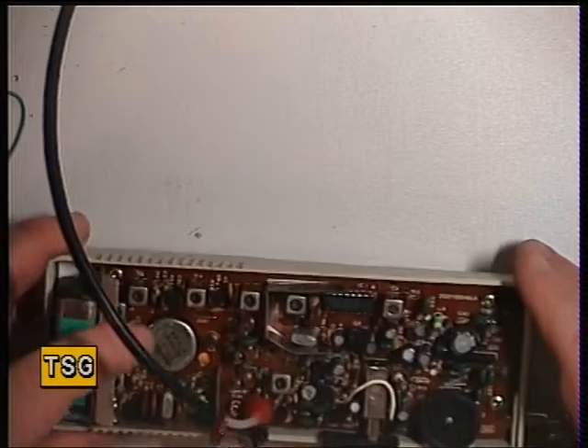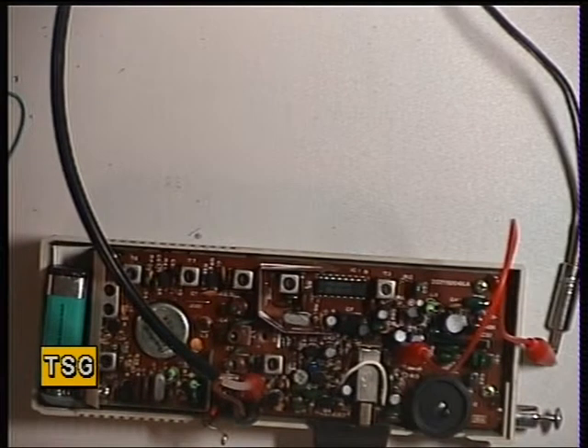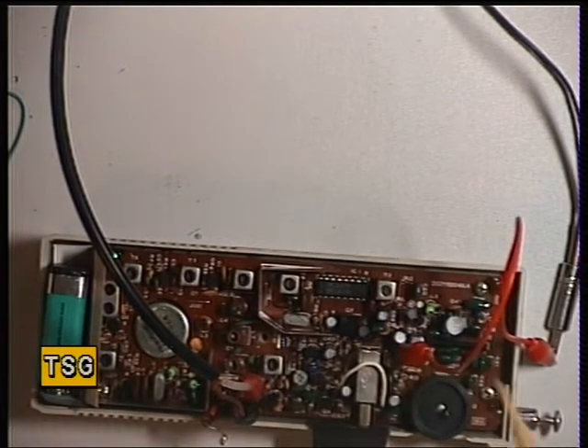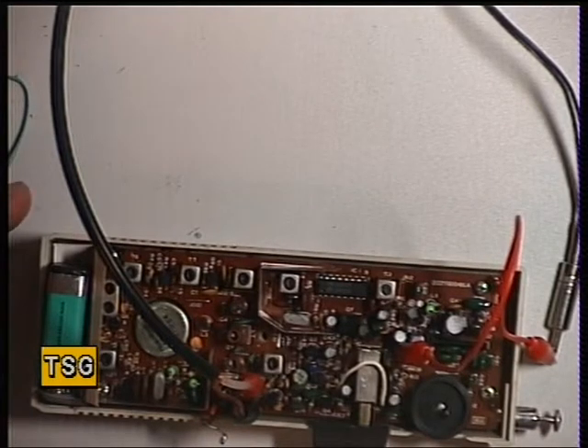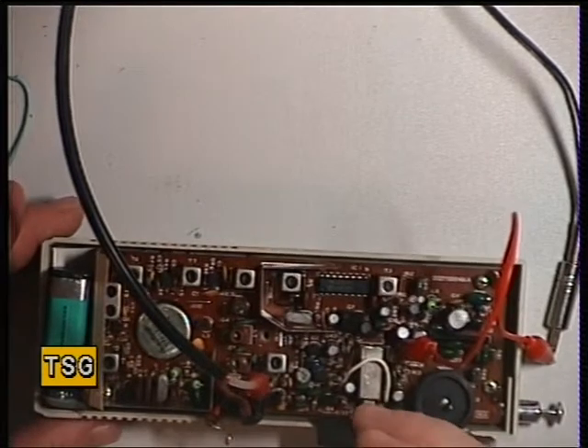What I really need to do is to connect my loudspeaker to the radio. I'll just pause the video while I find a way to do that. So what it is, it's test point 2. Test point 2 is just there, and I now have that connected through this little jumper lead to the audio input of the radio test set. So now we're going to adjust transformer 1.